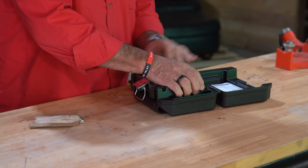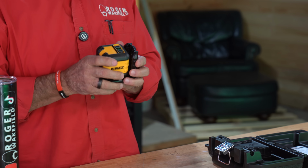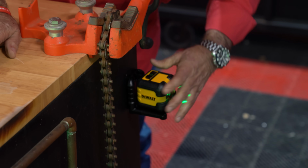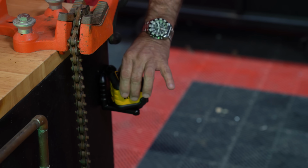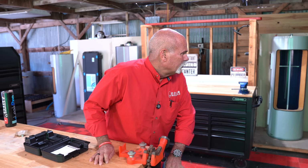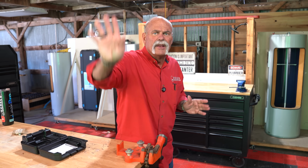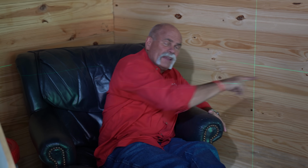And here's the deal. These are really nice. I showed you how the other one hung on the wall. This one's got magnets on it. So literally, you stick it on, you've got it set at the elevation you want, and you turn it. Now, the cool thing is, you line this up, center of the piece of pipe that's maybe headed to the wall, and then it's gonna turn and then go up, okay? So the good thing is, if I've got a piece of pipe coming straight over to here, and I know it's turning here, I've got my auto leveler on, I know where to put my supports to where I can hang this pipe and make it look good. I don't have to worry about pulling a string, hoping it stays level, and then making everything work that way.